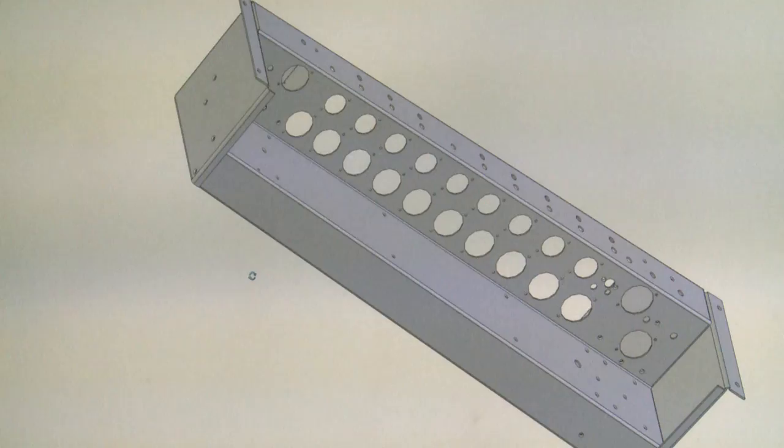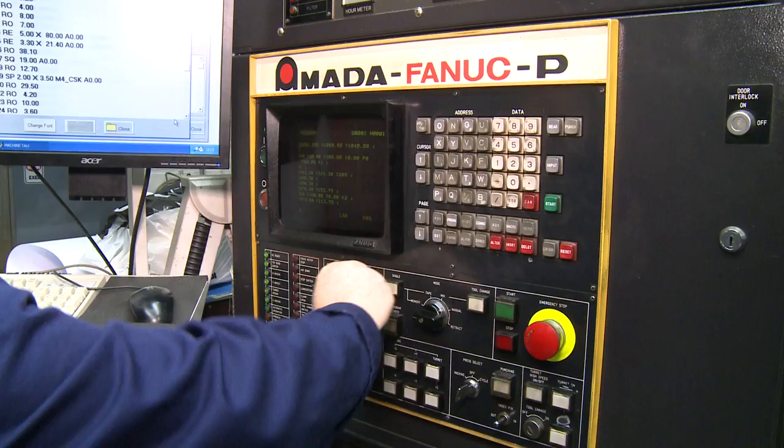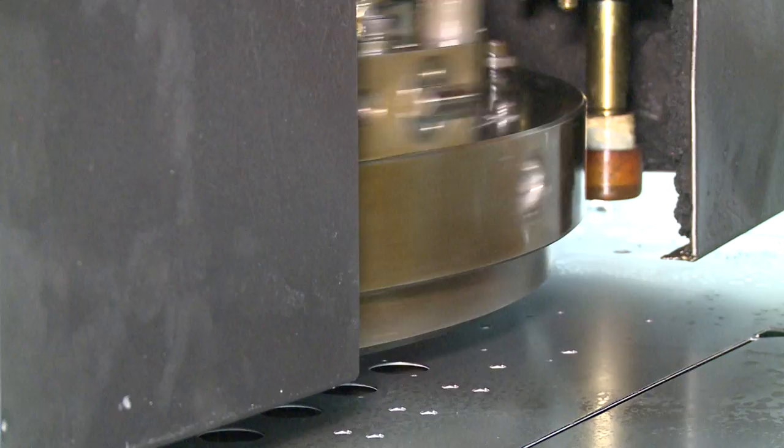There seem to have been six or seven different versions in the original EDSAC design, and the layouts of these can only be guessed from the photos of the original machine. This CAD program not only lays out the design, it also sends instructions to the machine tools which cut out each chassis. The mild steel sheets move in a programmed way, and a rotating turret of punches completes the work in minutes.